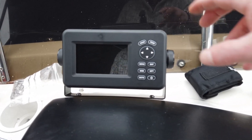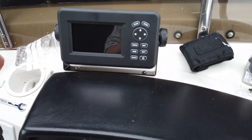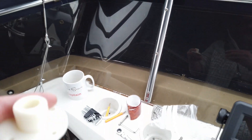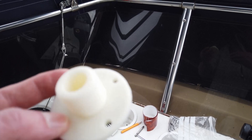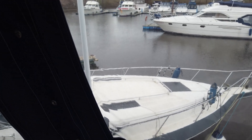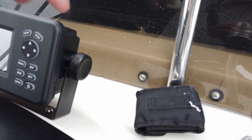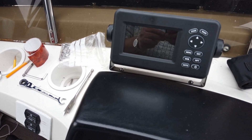So that was the easy bit — the AIS transponder and display bolted down. Now it's putting all the cabling in. We've got the GPS unit to put on the outside, and I've got my 3D printed foot — the cable for the GPS will go right through the centre of that. I've already installed the new VHF aerial on the outside, so that's in position with the cable passed through, and the power cable needs to go through as well.